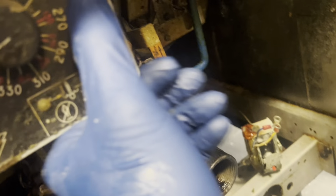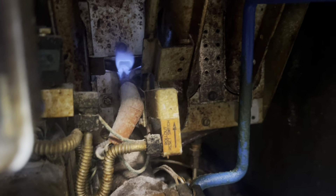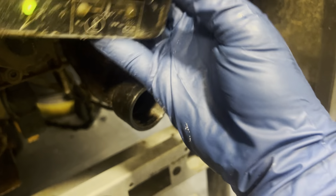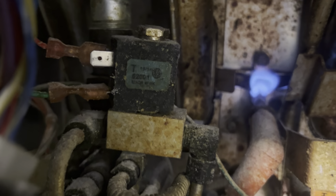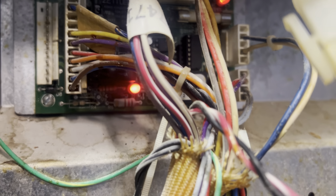Let me turn off this light, let's turn that on, let's make my 24 volts. That is the self-cleaning burner solenoid - pretty sure, which is that guy back there. This is why we test. Alright, I've unhooked that solenoid, now you can see that terminal - wait, here it comes.